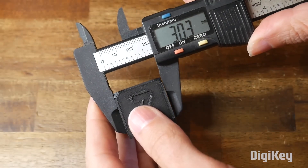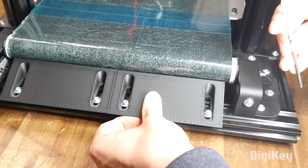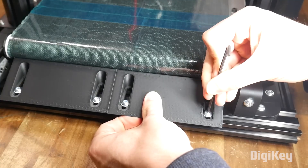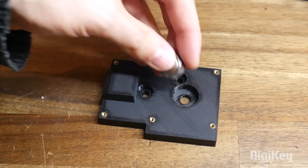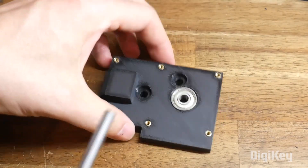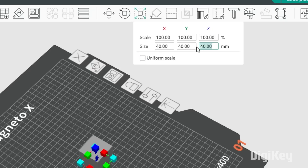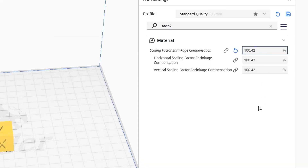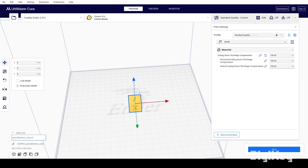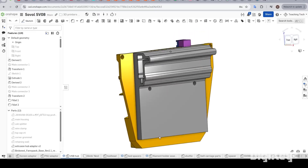Now for some tips and tools. One of my favorite tips this week comes from Teaching Tech, who shows how to calibrate and adjust for how different types of filaments shrink after being 3D printed. All 3D printed objects are prone to some degree of shrinkage once they cool down, and some formulations of filament are more or less prone to this effect. Usually you'll notice this problem when you design a hole with an exact diameter meant for a specific bolt size and what comes off the printer is too small to work. One fix is to scale the whole model up just a tick to compensate, but the real smart way to address the problem long term is to create a profile for your filament that accounts for its particular shrinkage qualities. This video from Teaching Tech shows exactly how to calibrate and edit these settings using different slicer options.